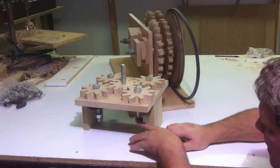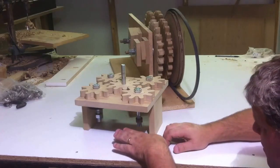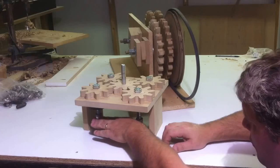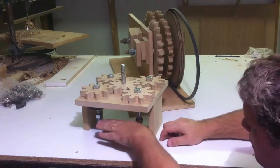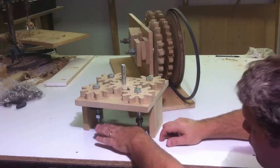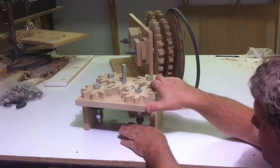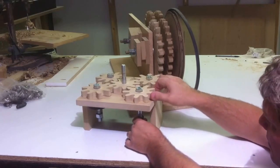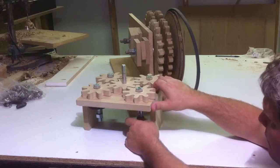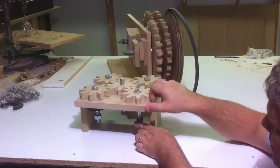your feed deck would be hooked to this, similar to if it was hooked in where the nuts are. So when you turned it, all the shafts are going to turn, but the nut's going to stay stationary because it's going to be hooked into the planer deck. And what that would do is, when you turned it, it would either raise it or lower it. So you can see if I hold that nut steady, it's going to raise it, and then if I reverse it, it would reverse it. So this is the way I plan on doing the planer deck.